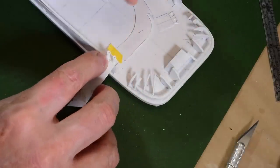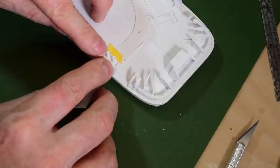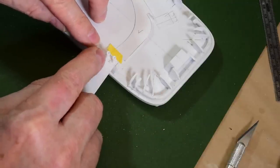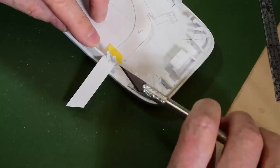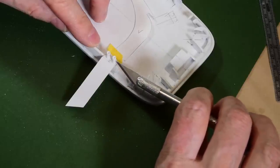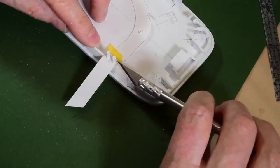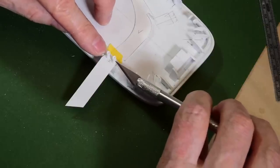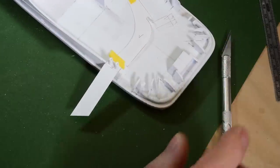So I'll install those, and then I'll cap those bollards, and then drill the side. There's still side pins that go on the side too. I'll mark those, and then use my number 11 blade to start the hole and drill and put some solid rod on the outside of each one of these, and then cap them, okay?